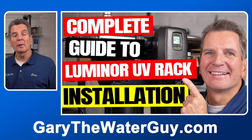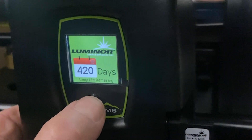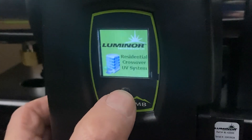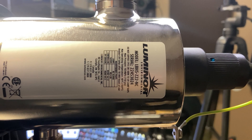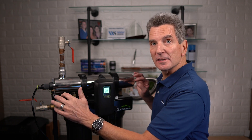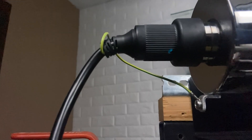I've got a great YouTube video that explains the whole Luminor Rack ultraviolet disinfection system installation — I'll put a link in the description down below. In terms of features, I rate these a 10 out of 10. Not only does the controller tell you how many days are remaining before the UV lamp needs to be replaced, if you push the button it'll also tell you the model number of the replacement lamp and sleeve. That same information is also on the back of the stainless steel reaction chamber on a sticker. I really like the little window in the sleeve bolt at the end of the reaction chamber so you can actually see that the UV lamp is on and protecting your family from bacteria.